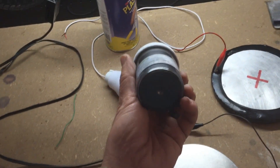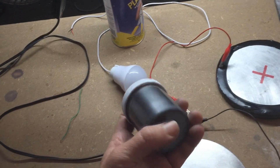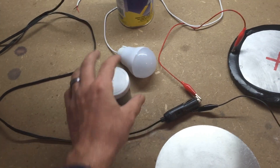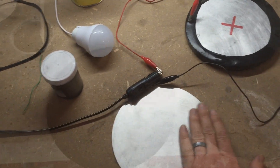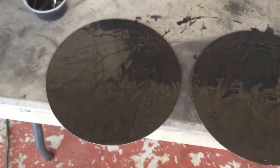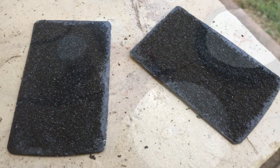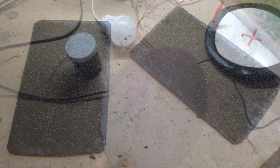What we've got here is the conductor, and I mixed onto it some graphene powder. This is a graphene powder — it's different from ultra-fine graphite powder. I'm experimenting with that as well, but I mix this with polyurethane as a binder and painted it right onto the surface. Then I take activated charcoal, grind it down into granular pieces, dust it on while it's still wet, and that binds it into the binder — giving you a lot of surface area.